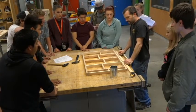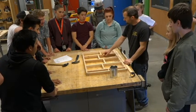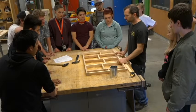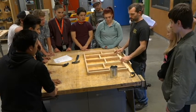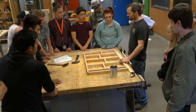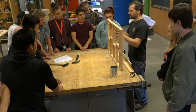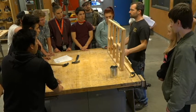The next step after you finish your base — hopefully it has been nailed correctly — is to check the lines. Looks like they're on the right side of the lines; there's a couple that are a little bit tilted, but it's not going to make too big of a deal. The only thing that worries me is that it is not square. See how I can lift this and twist it one way or the other? It wiggles back and forth, so it's not square.